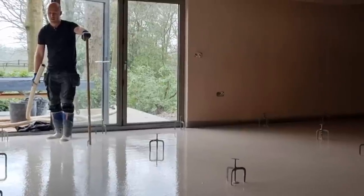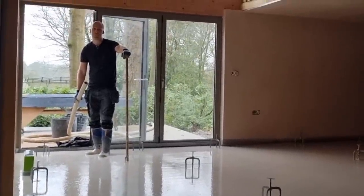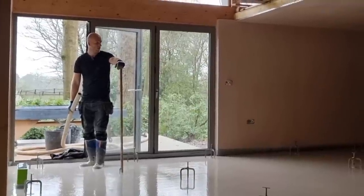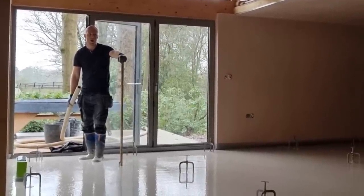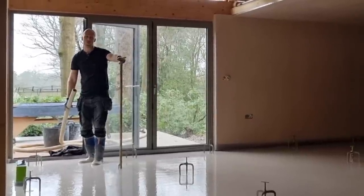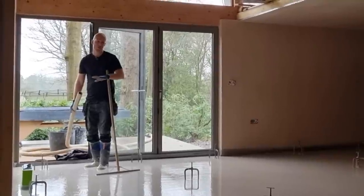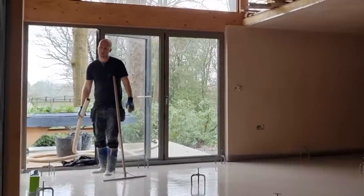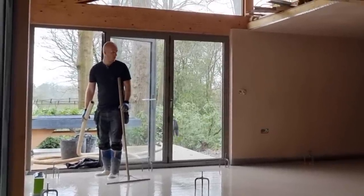So you got enough in? All done, yeah, we've got enough there. We've pushed through as much as we can out of the pipe as well, which makes for minimal wastage. Brilliant. And now what's the next bit? I'll just go around now, double check that we've hit every level, then take the levels out. And I've got some long tubular bars over in that corner. We just give it what's called a dapple. We go across the top with the bars, give it a light agitation to encourage it to settle, find the corners, and it gives it a nice finish as well. Yeah, it's brilliant.